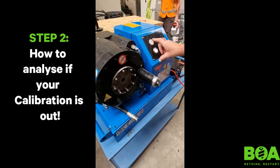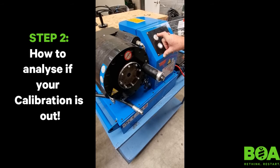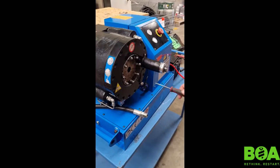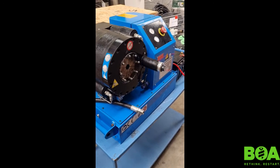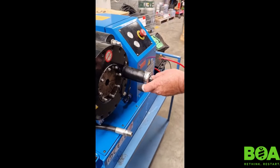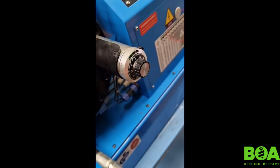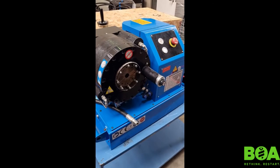You should have no less than a 0.01 tolerance on your setting. It should be right because you've got a 0.3 tolerance when you're doing your crimping — under and over — so you're taking away from that straight away. Bear in mind, when the die set is made it's made as one piece and then wire-cut through, so there is going to be a gap, but it is a closed position. If it's not, we remove this unit and go back to zero — zero on the dial and zero on the top — so we can confirm it is zeroing down to where it should be.